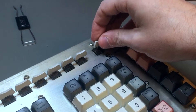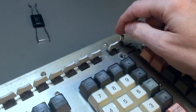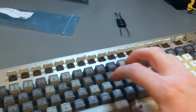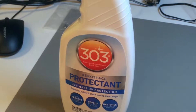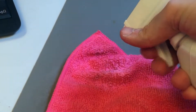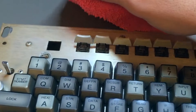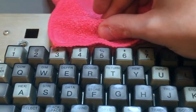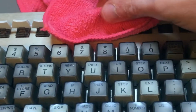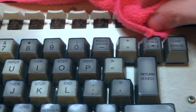These are the function keys, and that's the last one. I've retro-brighted them and I don't want them to darken again. They were very, very darkened before, and eventually they will get darkened again. So to delay that, I'm applying a UV protector — a fluid that filters out UV light. I just need to rub it on the desired keys. I've done it quite carefully, in the hope that they will remain light-gray for as long as possible.